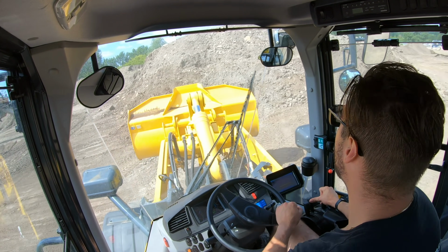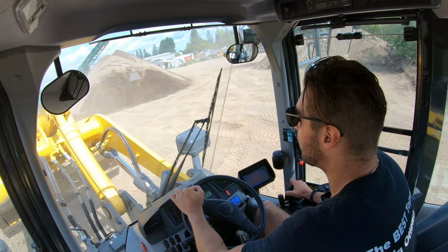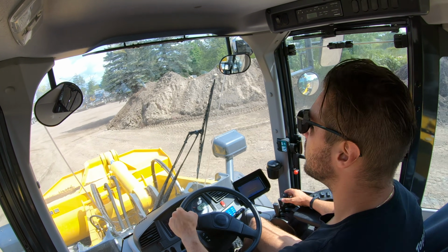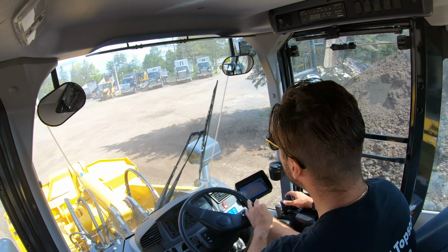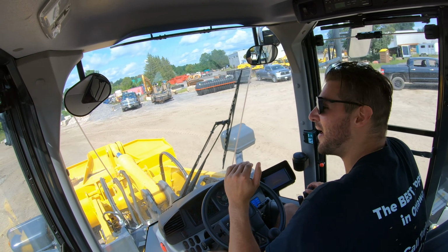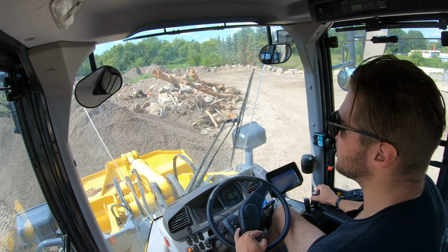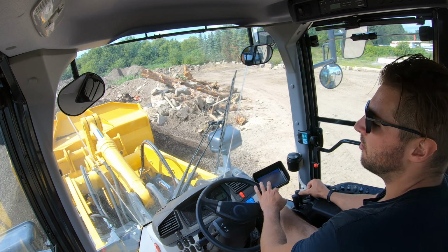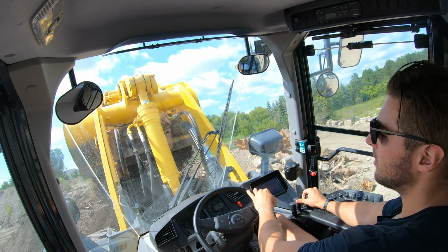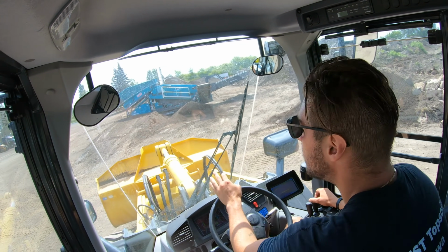And our yard is not smooth by any means. So you could grab this, pretend you're dumping your tailings, back. Oh, there's a truck pulling into the yard, we gotta load it, forward, bucket down, throttle down, and you're going. You're driving over to where it's going, we're doing 25. You would never do 25 kilometers an hour in our 450. Come here, gear down, go into the tailings pile, shift downs into one, push up this, get up on the pile, stack it up a bit, reverse, back down, and you're good to go.